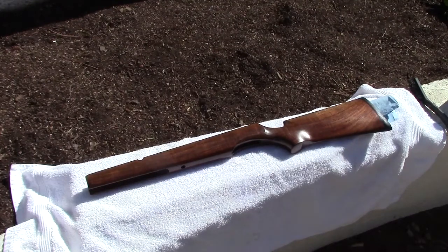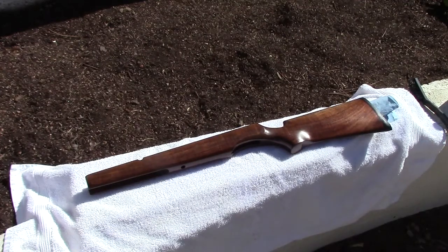And so then another maybe dozen wipings of oil, which you saw me do. It takes a fair amount of rubbing. It deposits an extremely tiny amount of oil on top. You've got to really rub it to get it to take it all. So about a dozen applications of that to bring the sheen of the finish back.